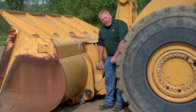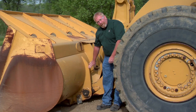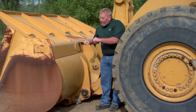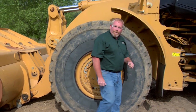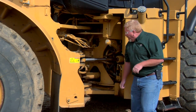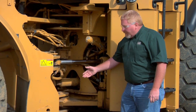We should put this machine down today and repair this problem. Do some measurements on the bucket and make sure that we haven't worn too much — we want this bucket to be nice and tight. While we're talking about grease points and lubrication points, let's move over here to the hitch. Now the hitch area has quite a few areas that you need to look at. Not only do we have the steering cylinders, we also have some of the grease points for our boom and bucket linkage.